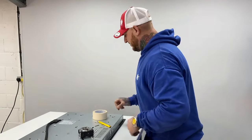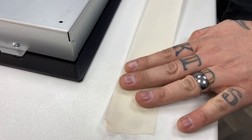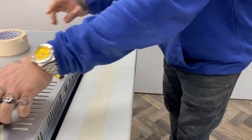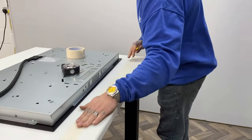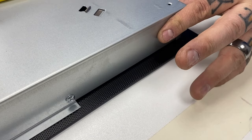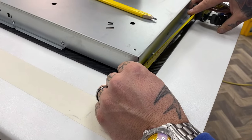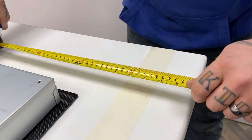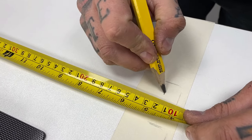Slide the hob out of the way and we're going to use a bit of masking tape. You can still see the line through the masking tape which is nice. Now I've got two marks here — one was incorrect at 150mm, the correct one is 100mm. From those marks you're going to measure inwards — the hob lip is 15mm from the outside edge to the cut mark. Come in to 100mm on your tape and work back: 5, 10, 15 — that gives you your cut line.